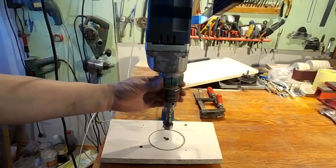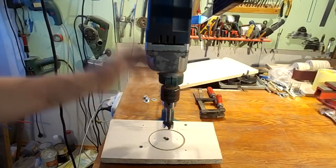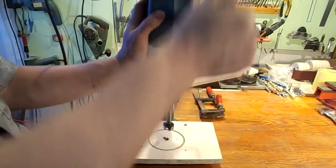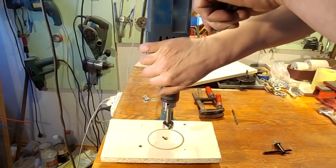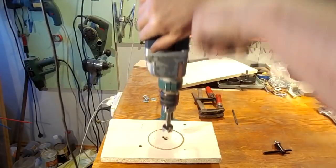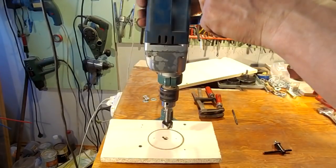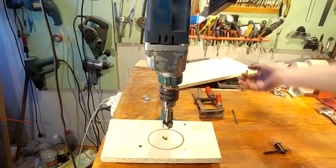The second serious drawback is the play in the horizontal plane. You can see that this backlash reaches more than five millimeters — it is absolutely impossible to get to the right place. In general, the manufacturers of this rack made a product with an incomprehensible application and a lack of accuracy. I did not try to eliminate this flaw.